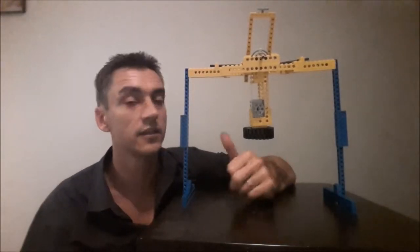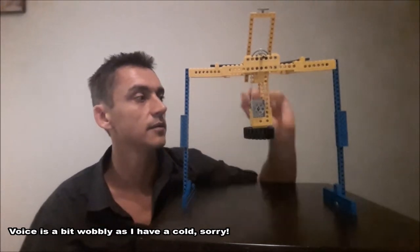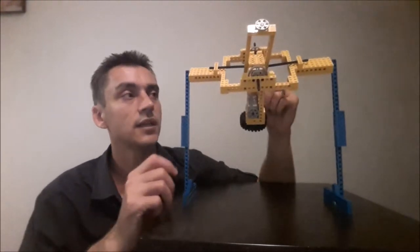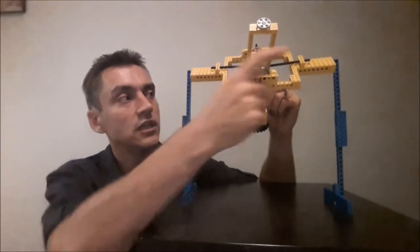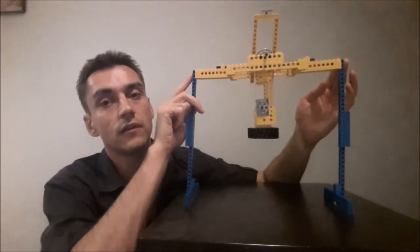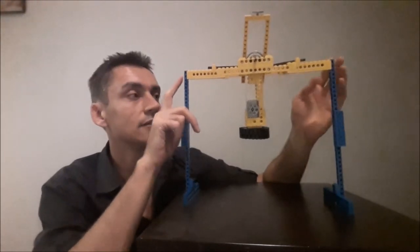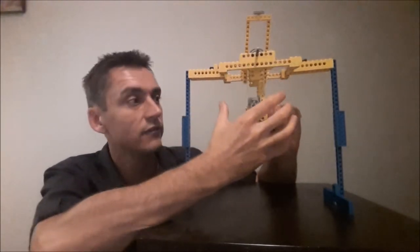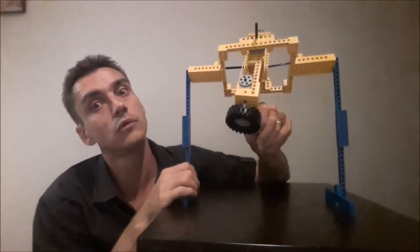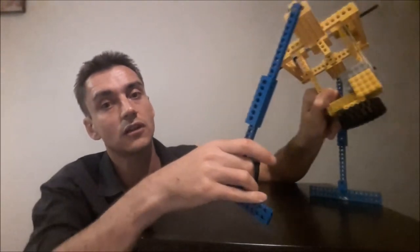This is what I came up with — BB-8's main drive mechanism, or my BB-8's main drive mechanism anyway, because there are lots of different ones out there. It's pretty simple. Basically he's got two main drive motors, one each side, and they attach to the inside of the sphere via two axles exactly halfway up — at the equator. Because the main mass of the drive is hanging down, when you drive these motors forwards it attempts to move that mass forwards and up, and because it's now overbalanced it causes the sphere to start rolling forwards.